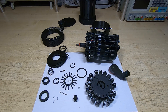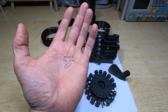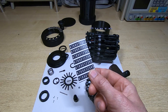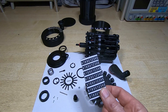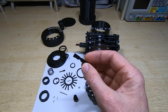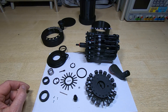Some of the other parts are much smaller — the carry lever spring for this small version is of course much smaller than the one from the first unit. The text was simply scaled down and fitted in the same way, then the wheels were lacquered to protect them. Other parts are just small and a bit fiddly. Even so, you can still print things like the slides fairly well with a 0.4mm nozzle. Parts like the spider spring are just scaled-down versions of the previous one.